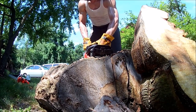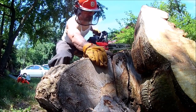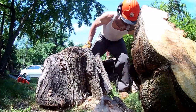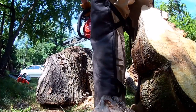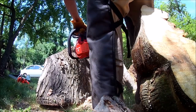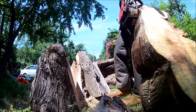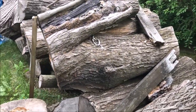Here's the Craftsman making an appearance — this is a 46cc Craftsman, still available at Lowe's. I got this one at a Lowe's in Virginia when I was visiting my friend and drove it up to Massachusetts. That made an appearance to get the final cut because I have a 20-inch bar on that one. The chain's a little loose, but that's okay. Those chains that come with it use a weird semi-chisel safety chain that's almost impossible to sharpen and you can't do any plunge cuts, so I ended up replacing it.